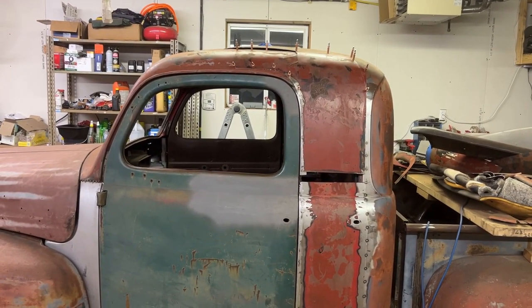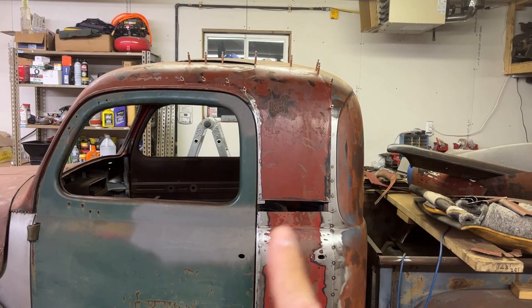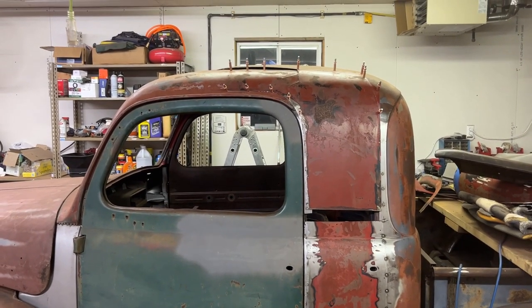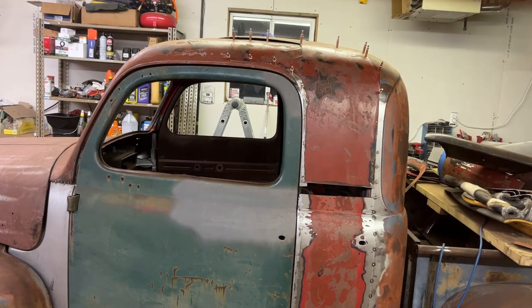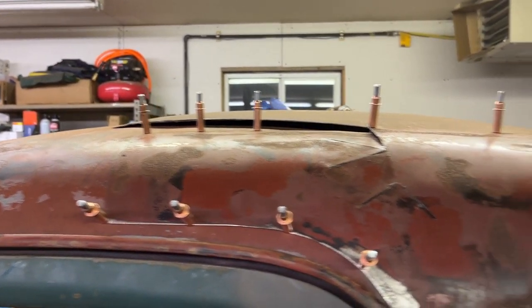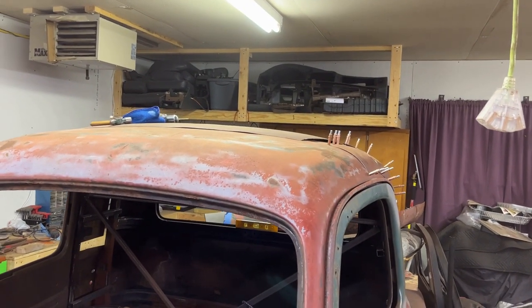The window frame has been cut out for that little corner window and I put in the patch panel — that was the outside skin of the spare doors. My problem is this section from here to here is flat, then from the door jamb forward it tapers in a little bit because these cabs are shorter up front and wider in the back. I put some relief cuts in there trying to get it to relieve so it can sit in there — it kind of looks like it fits but it's still ugly. I still need to cut out the middle of the roof too.